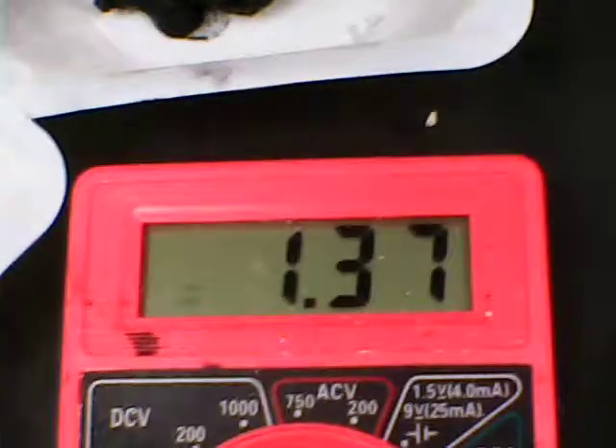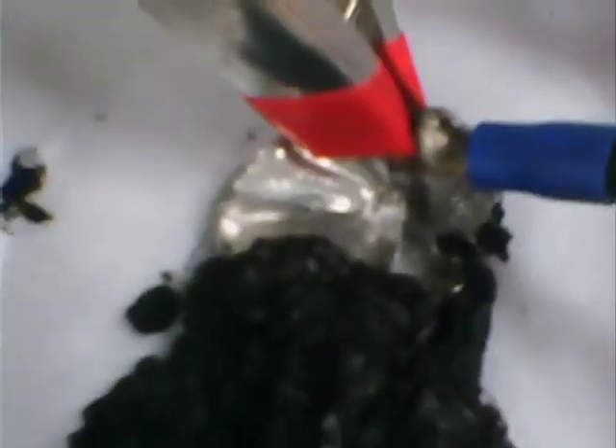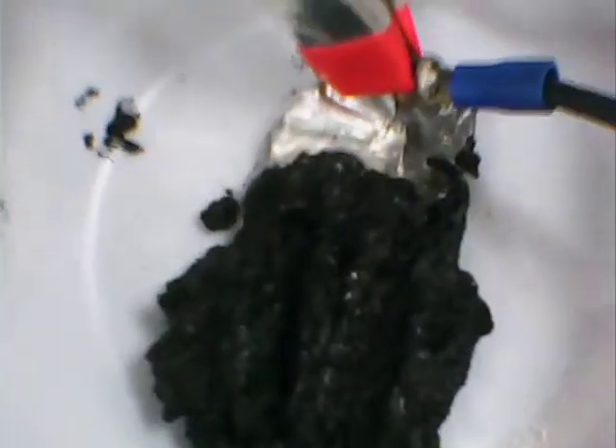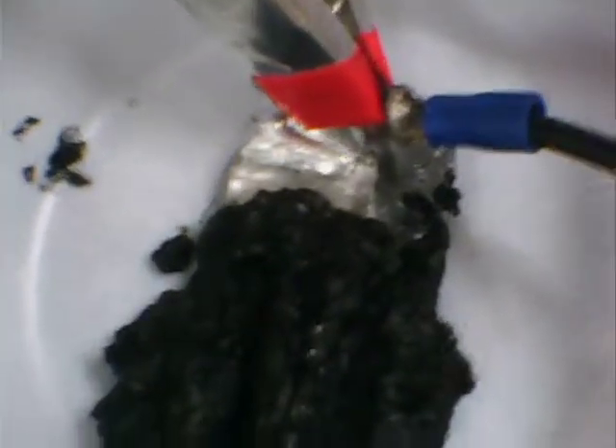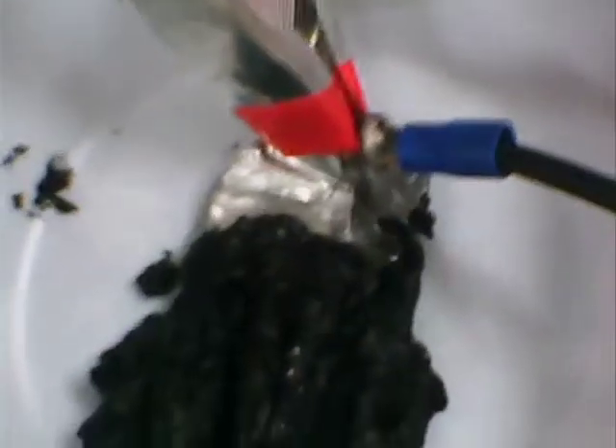I have a little piece of graphite in there as the electrode — I don't know if you can see it. That's where we're at right now, and it's holding steady at 1.37 volts. We'll see tomorrow what it's like; I'll upload my results. That zinc is insulated by this membrane, which is important, and we expect that the alkaline conditions will complete the circuit. It will be interesting to see, exposed to the atmosphere, if this potential is showing up in a week. Anyway, I'll keep you posted. Bye for now.